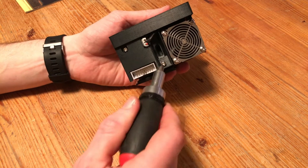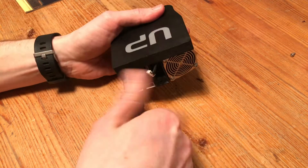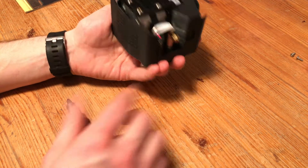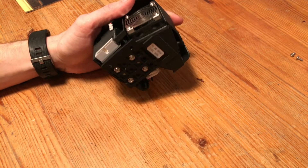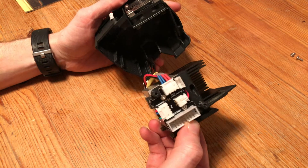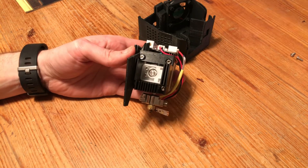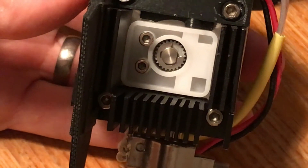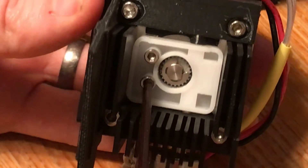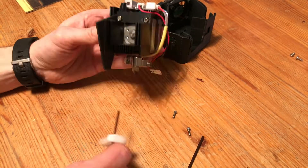So we're going to check the drive gear first. On the Upmini 2 printhead there are two screws and a fan cable. Unplug the fan cable, remove the two screws, and then you should be able to grab hold of the entire stepper motor unit by the injection-moulded housing and pull it out. Fingers crossed we're going to see a blocked unit. So here we've got the gear itself — let's see if we can get in there and have a look.